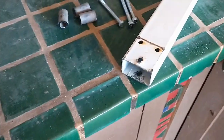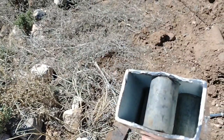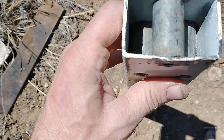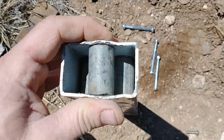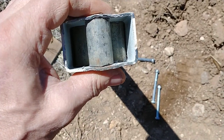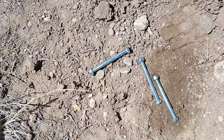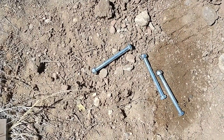I'm going to get this all put back together and with any luck get the tracker back online this afternoon. I've got all three sleeves pounded into place — they're fit in pretty tight, so they should provide some support against the side walls so it won't be as weak as it was before. With our grade 8 bolts going in, we should not have that failure again — or at least I hope we don't.